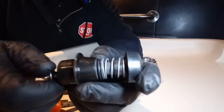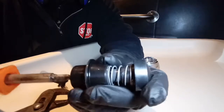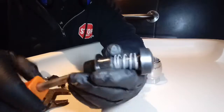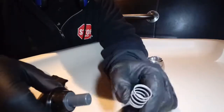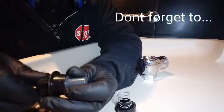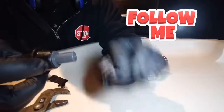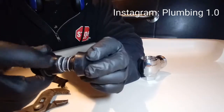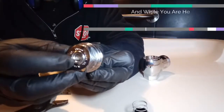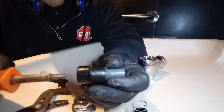Now, when you're going to unscrew these things, it's going to be coming back. And if you notice some tension and it stops and you're trying to reef on it and it's not coming out, don't force it. Because this is going into plastic, and you can screw those threads up pretty bad. Worst case scenario would be if this is popped out like this and it's holding the water off, and you get it to come back enough where it starts allowing water pressure to come through into this area. The only thing preventing it from pushing water through this hole is this rubber seal in here.